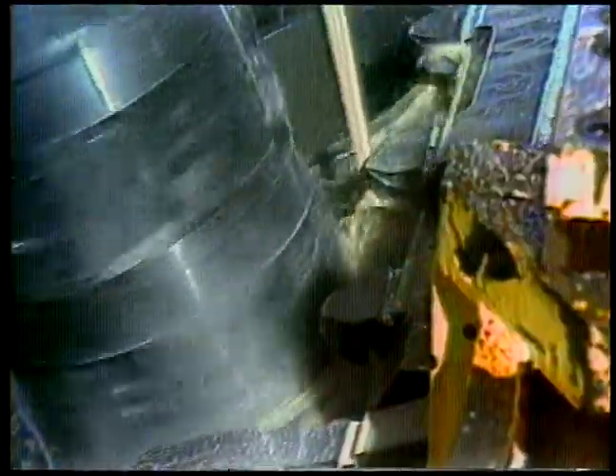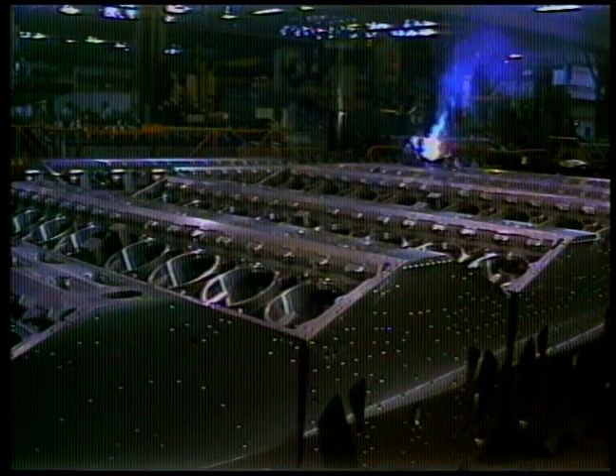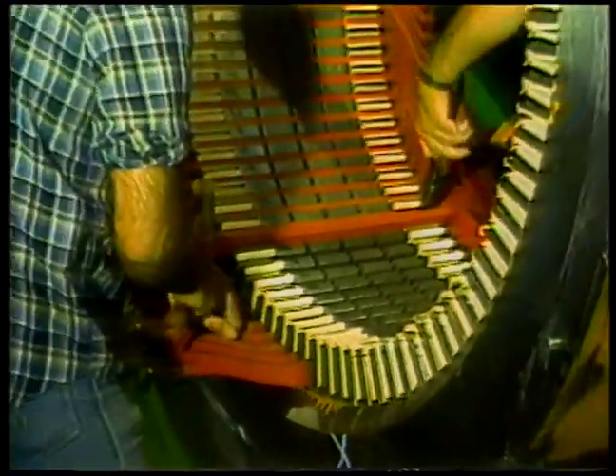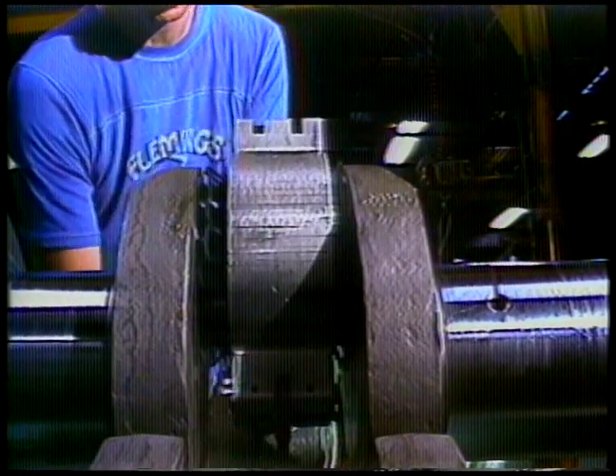From the boring of 16 cylinders in each crankcase to the grinding and polishing of pistons, the 83-acre Electromotive Division plant in LaGrange, Illinois, is an immense showcase of high-tech in action. Its production hardware, non-existent three years ago, is vital to the 60-series' standard-setting performance and cost efficiency.